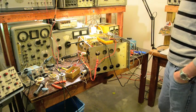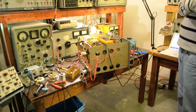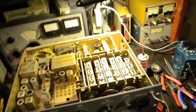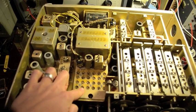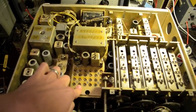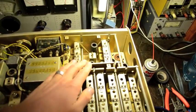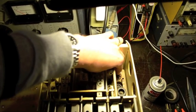Starting at around 8 MHz, the radio comes to life, but below that this radio is dead. What I found is, initially I thought the crystal oscillator deck had some issues below 8 MHz. But it turns out, according to the block diagram, there's actually a first mixer here that's mixed with a 17 MHz crystal. That 17 MHz crystal resides right there.